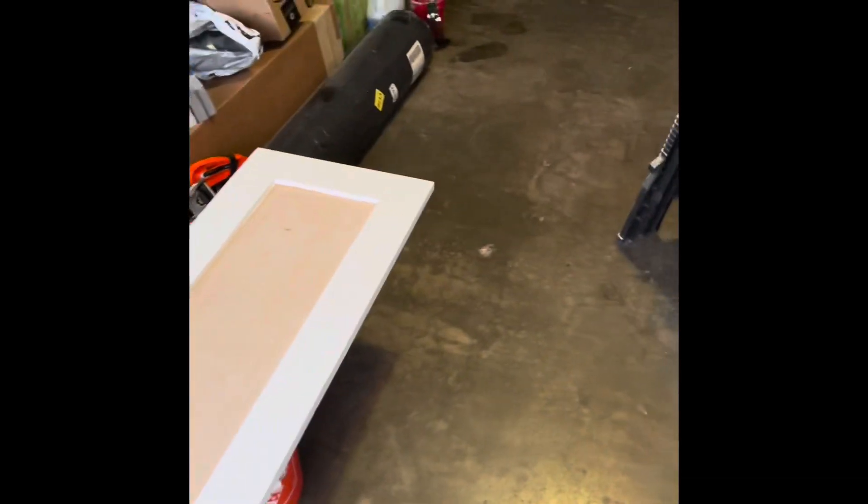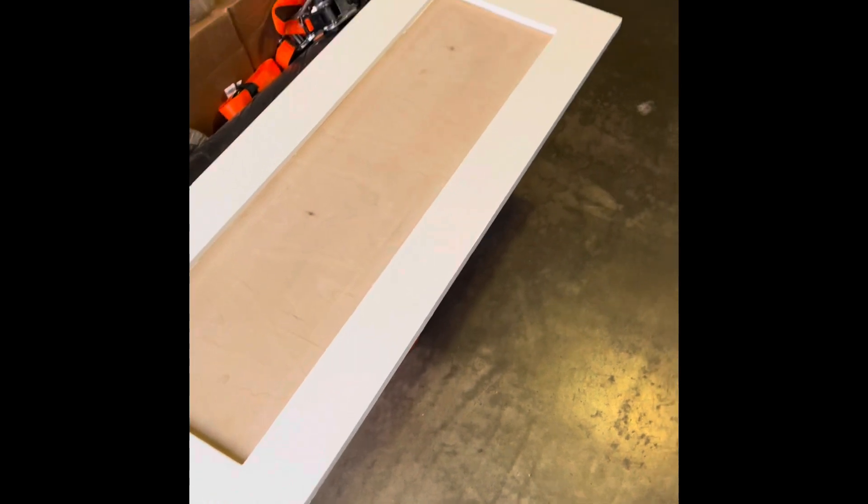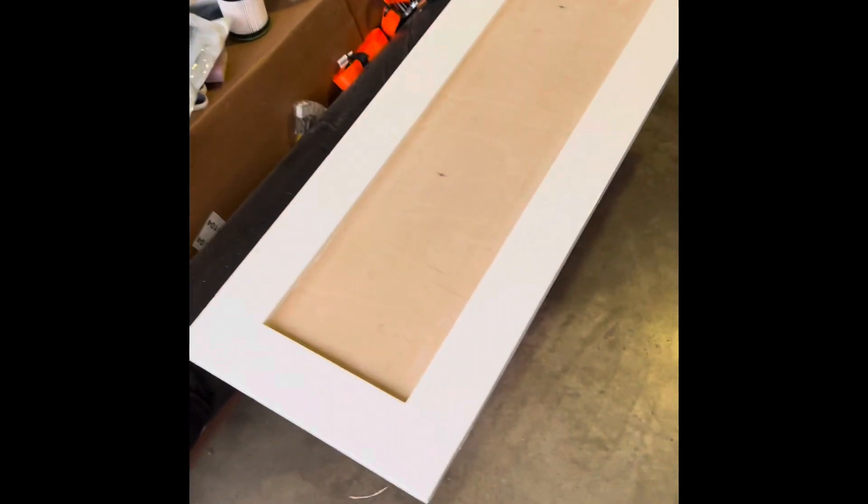I'm hoping for a little more production — doing all my cutting at one time, all my drilling at one time, all my sanding and painting and dowels at one time, and then laying the natural colored wood in very last after I have painted the frame of the door.